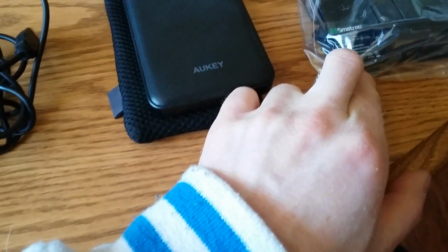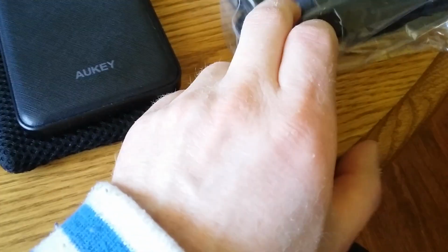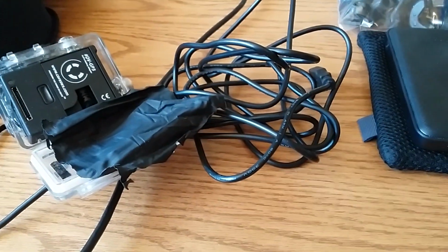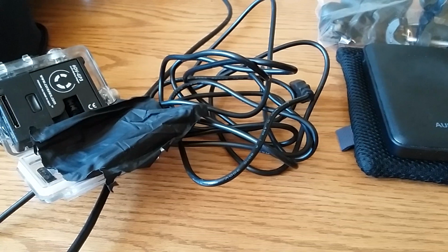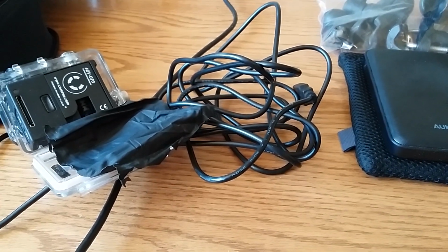The standard GoPro batteries are either 1150 or 1200. I've got some third-party batteries here that I purchased, but I still have one of the old original GoPro batteries from when I first got this thing, when the Heroes first came out. What's it say on the back side? It says 1150 milliamps. So, put that in perspective. Let's think about it this way. The GoPro consumes approximately, by numbers that I didn't create but that you can find on many forums, around 1,000 milliamps an hour.